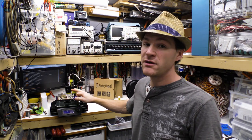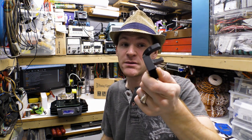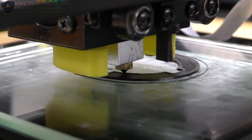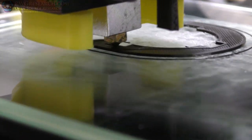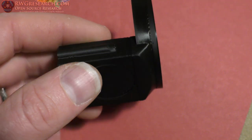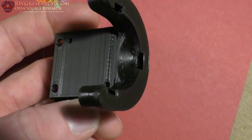The yellow pieces on the SD card include the actual files for printing replacement parts — I printed a black fan cooling channel. These are already sliced and ready to go, so I recommend printing some spares in case you break the originals. I sped it up to 400% and it had some trouble, then slowed to 200% — you can see the plastic is more glossy at 100% and gets more dull going faster. I was pushing past its maximum speed to see what would happen. Definitely stay within the boundaries — I believe the max is around 80mm/s on this machine.